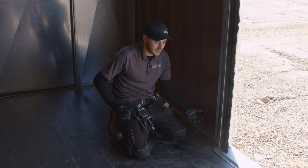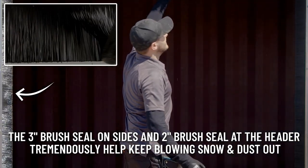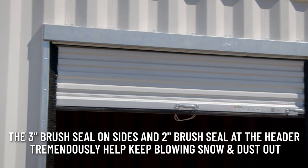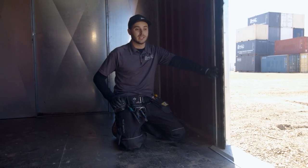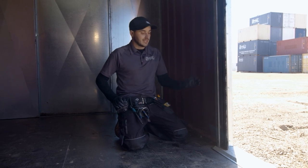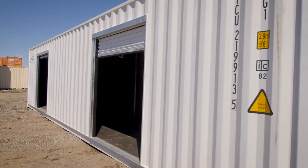Some of this is inherent with installing a 26 gauge thin sheet metal roll-up door on the side of your beautifully sealed shipping container. So you can expect it not to be quite as wind and watertight or as rodent proof as it would have been if you didn't modify the container. But a lot of people find that sacrifice worthwhile for having the extra access into the side of your container.